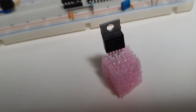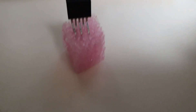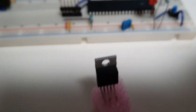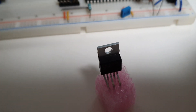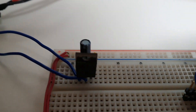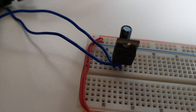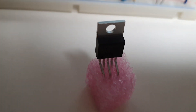The way it achieves this efficiency is through switching mode - it uses an inductance. When I first got this thing I didn't think about that. I just bought the regulator without buying the inductances. I went to look up an example circuit with the same mindset as you'd have with a linear regulator - those you just hook up input and output, maybe throw on a capacitor for filtering, and that's all. These guys aren't quite that simple - you need an external inductance and a pretty beefy diode.